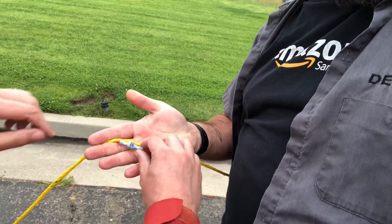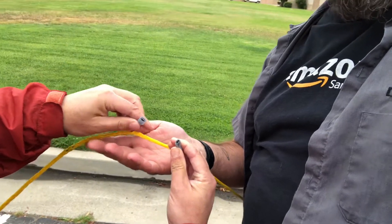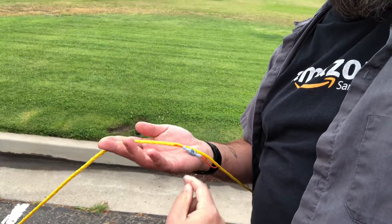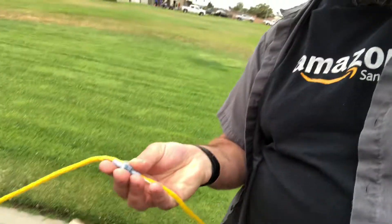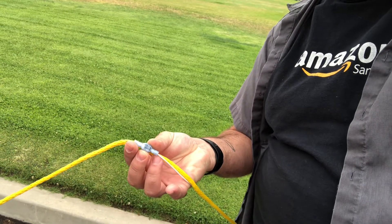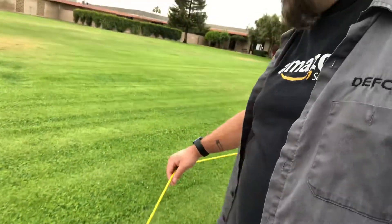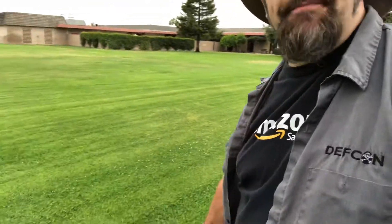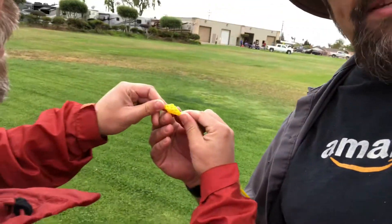The different bands are actually labeled on the wire. He brings the wire out and puts a connector on it so you can disconnect and reconnect different lengths of wire. The one here is a 20-meter section. You want to make it 30 meters — you click that in. You want 40 meters — you continue on down. Here's the 30-meter connection; disconnect this and it's a 30-meter antenna. Connect it and continue on down for 40 meters. You can see the tip of the wire in there.